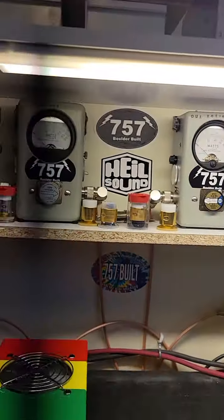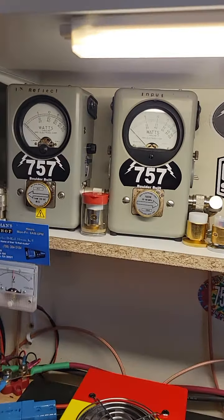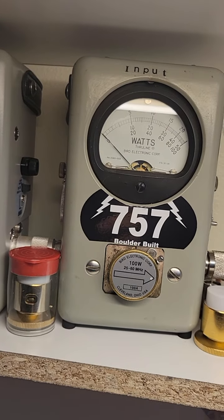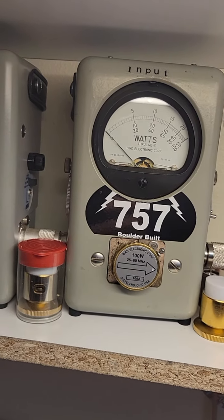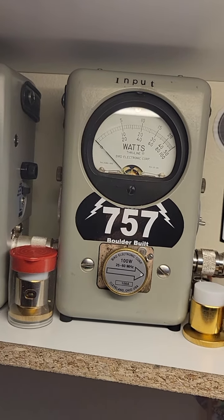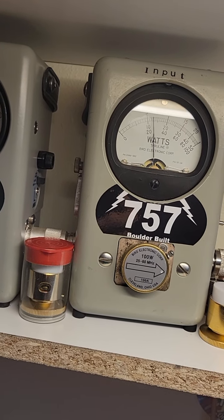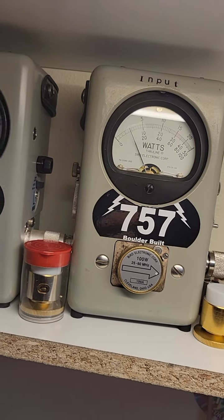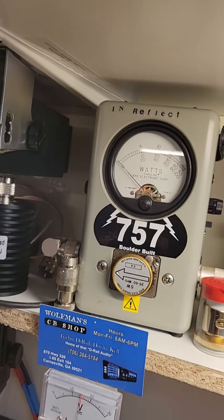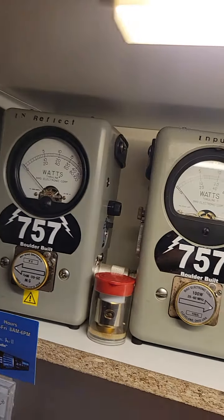And the customer that is getting this is going to be running it off of a 60-watt radio, so I've got it turned down to do just that. This is the input. It should show close to just under 30 watts RMS on this meter. Audio, hello, oh yeah, right there. And we'll look at our pass-through. Audio, hello, oh yeah, barely any movement.